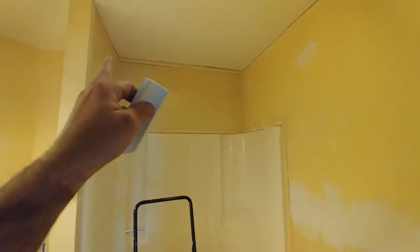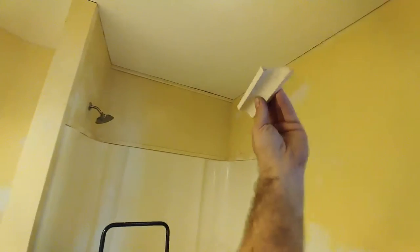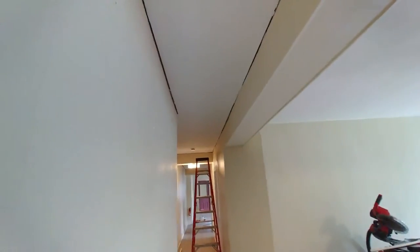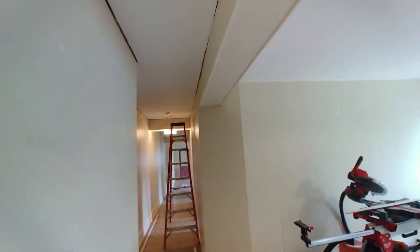In a case like this I put my straight-cut ends on that piece because that means my cope for that wall is going to point away from me — you'd have to be standing here to see into any crack, which there won't be. That's how I picked that wall. This wall gets a straight cut, that wall gets a cope piece, and so on. You can alternate: sometimes one end will have a straight cut and one end will have a cope, depending on whatever configuration you have for the room.